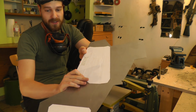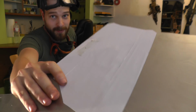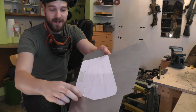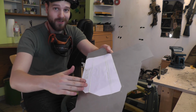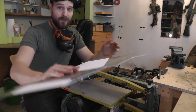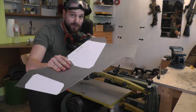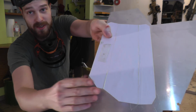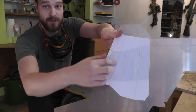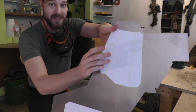And the point is not that it's non-permanent, it could be permanent in this case, but the point is that they are attached over the entire surface, so when I cut, they won't be flopping around under my blade, which would be annoying. And before you ask where I get aluminum, I order it online. Let's cut this. And the way I'm gonna cut this is, I'm gonna cut out this entire shape first, and then I'm gonna do the two small cuts separating this into three pieces so that those pieces align nicely.